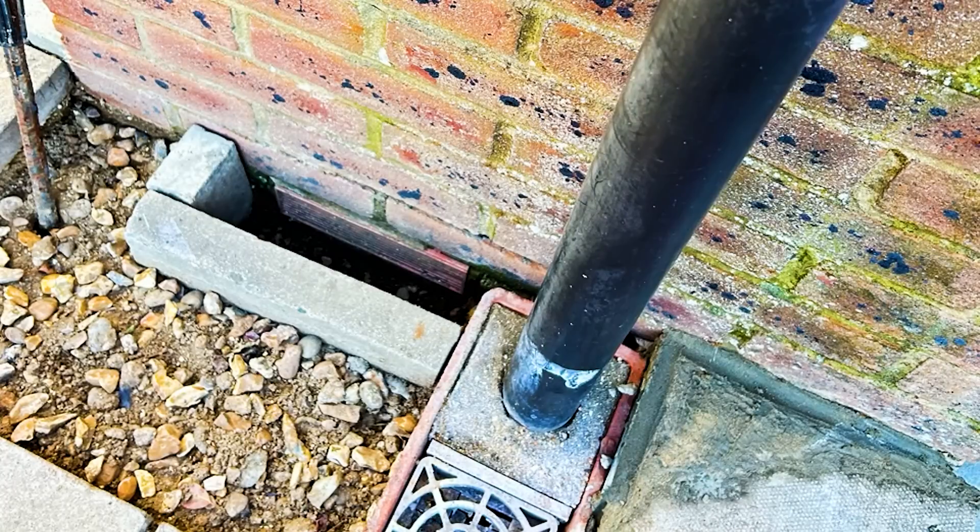When I sent Allison my reply, she said 'thank goodness for that' because everybody had been telling her she was wrong and it wasn't a problem - but it definitely is a problem. As an interim measure, she could dig out the area around the air brick so the ground is lower than it, and put some gravel down so any water soaks away from the air bricks rather than collecting around them.